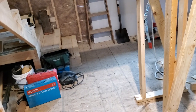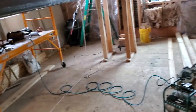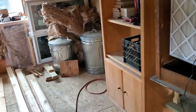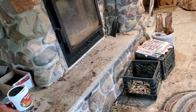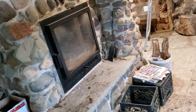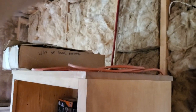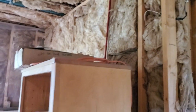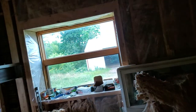The basement floor has a little buckle to it. I try to dehumidify but in the winter there's too much humidity — I need to condition that space. So a forced-air furnace is going in down in the basement. He'll have plenums running underneath this floor and they'll pop up to heat this floor as well as downstairs, and we're going to run a supply and return behind this false wall here to heat the second floor eventually.